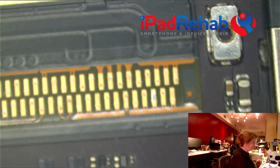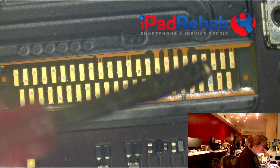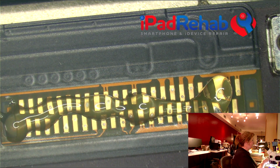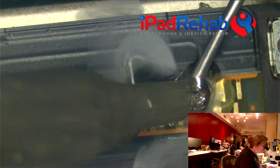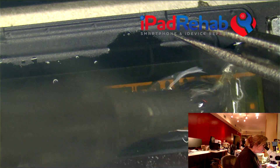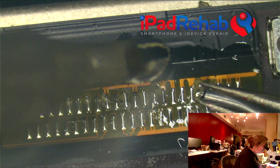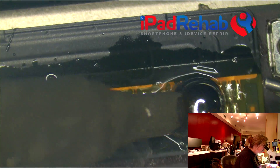I'm going to use an iron that has a big fat wide tip. Let's heat up that iron. The key to getting these off is to add a lot - more than you think - of solder on top of the connector and work that in to reflow these joints using your leaded solder, which will have a lower melting temperature than the lead-free that's on there. I've got some solder I'm going to feed into these joints to reflow them. You could use chip quick to get an even lower melting temperature to get this connector off.